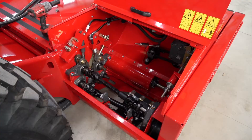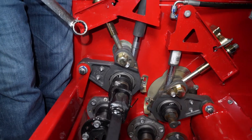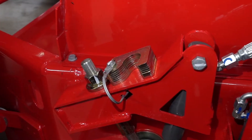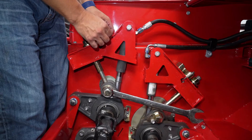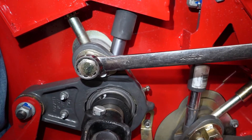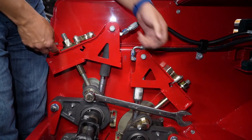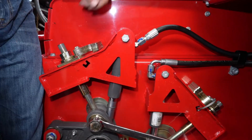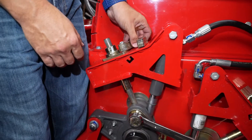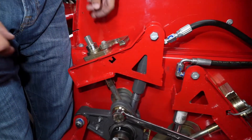Then you do the same thing on the front side. For roll gap adjustment, new for 2020, we added this nice feature — we have these shims. Each one of these is a sixteenth of an inch. So if I want to raise it up by an eighth, I'll pick two of them out, raise this up, bring two of them in, and let it back down. We just added one eighth of an inch to the roll gap. If you're doing a crop like oats, you want to put some more roll gap in there. It's as simple as that.